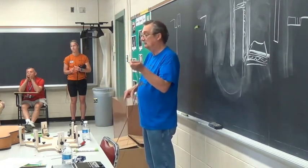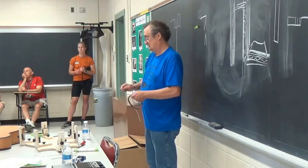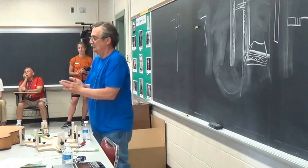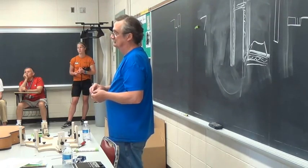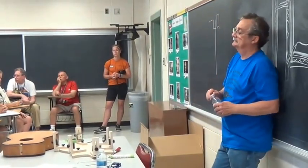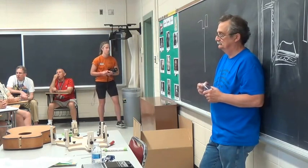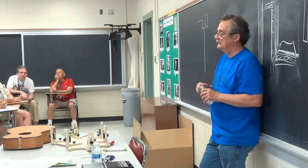We do a lot of restoration work in our shop. These are fantastic building techniques, but I've always struggled with the glue and the lacquer, and also the fact that when it's manufactured, this is all done prior to finishing. So everything, regardless of whether you scrape the wood down, scrape the binding or whatever, is flush, and then the finish goes on top of that. So when you're doing the restoration, you're going to have to do finishing work. And I've always shied away from using that type of glue on this type of stuff, even with restoration, because you're not guaranteed the holding power for the length of time. You want to get that stuff melted into the wood.